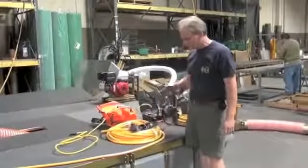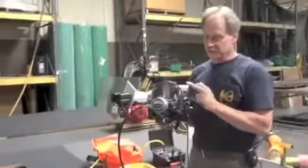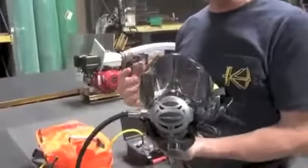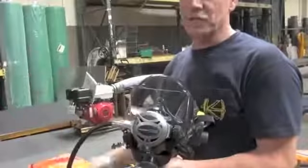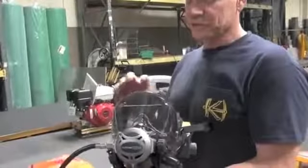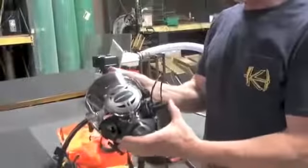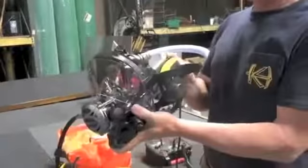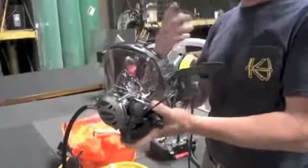This unit actually has it set up with an underwater communication system. It's actually an Ocean Reef mask — it has a built-in microphone and a built-in earpiece. What this will allow you to do — I believe it's called full duplex — you'll be able to talk back and forth to the other diver full-time, and you'll be able to talk to the top man full-time. You can see we mounted a mic inside the mask. This is a pager bud — it's kind of like a warning if you need to get the top man's attention. And this is your earpiece that you hear through. It's actually like talking through a walkie-talkie, except it's full duplex so you don't have to push any buttons.